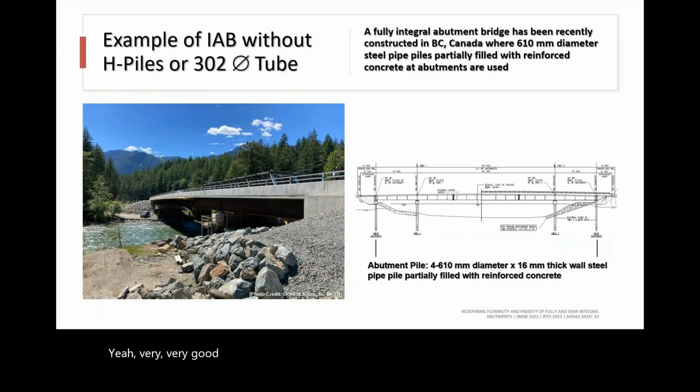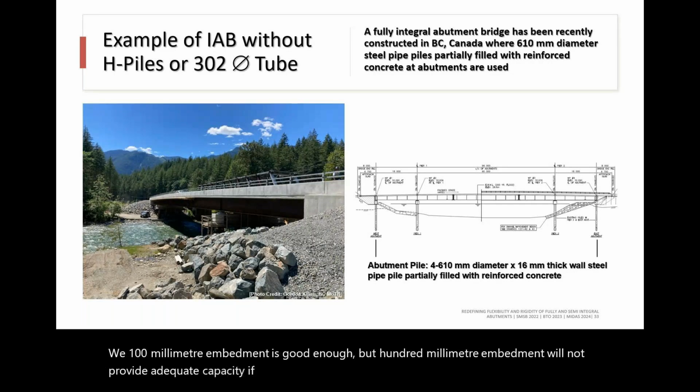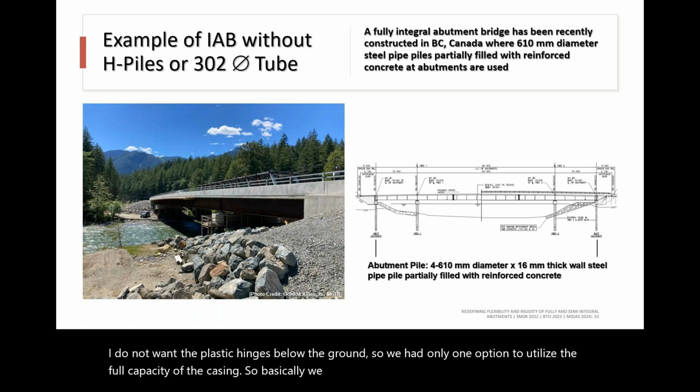So if we do not want the casing capacity, 100 millimeter embedment is good enough. But 100 millimeter embedment will not provide adequate capacity if we consider the steel casing. For example, in this bridge in BC, we have to consider the seismic load, and the client did not want plastic hinges below the ground. So we had only one option, to utilize the full capacity of the casing. So basically, we embedded the casing